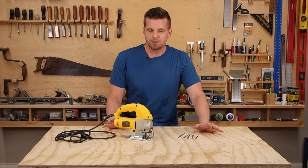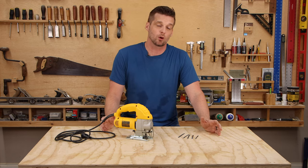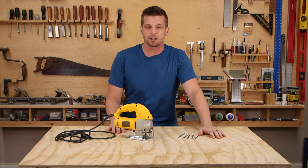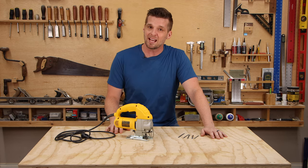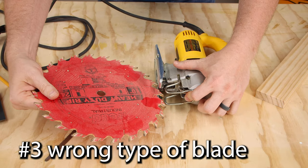What a lot of beginners don't know is that there are probably a dozen common jigsaw blade types and who knows how many specialty blades. There are blades for cutting metal, plastic, laminate, lighter woods, denser woods. There are narrow scroll blades for cutting tight corners, blades that cut on the upstroke, blades that cut on the downstroke, blades that cut on both. Within each material type there are different numbers of teeth and different tooth styles that cut fast and ugly or slower with less tear-out.